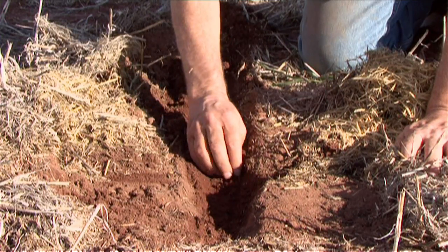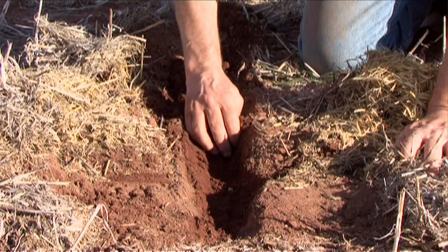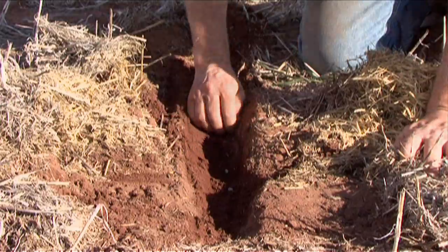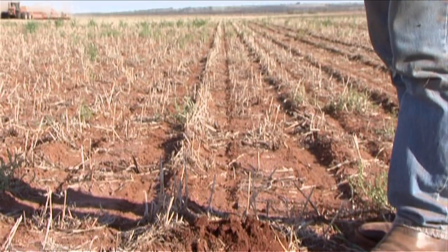With the knife point we get a lot of mixture of wet and dry soil after seeding, whereas with this machine it seemed to keep the dry soil on top and the wet soil underneath — and that's where the seed was. I think that's why we got such good germination, because there was no mixture of wet and dry soil.